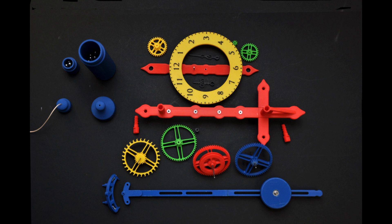To get all of the parts to this stage, I have already solvent bonded several of them together. The front frame has two dial spacers bonded to the front face and the dial bonded to that. The rear frame has three wall spacers bonded to the back, and the pendulum rod has been bonded to the pendulum head. The front and rear frames have the ball bearings pressed into them — these should be a tight enough fit that they don't fall out during assembly. The gears have all been press fitted to their shafts and their positions checked against the dimensions on the supplied drawings.